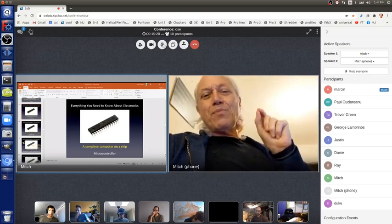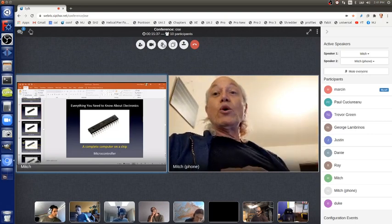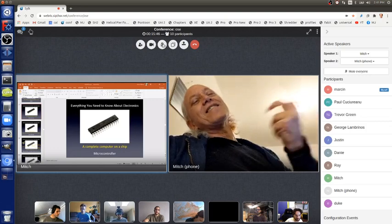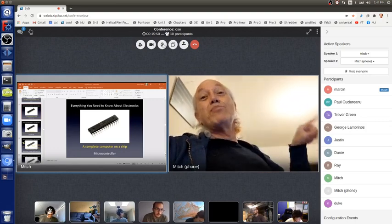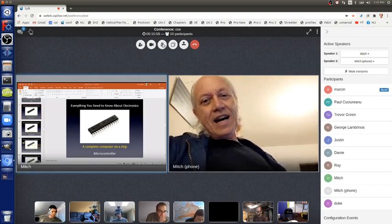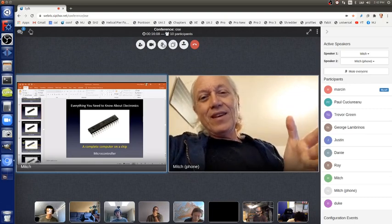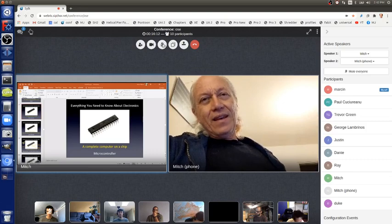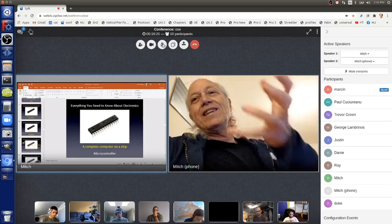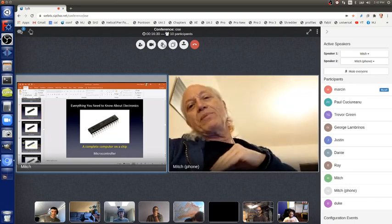Okay, so there's a small part of program memory that you need to have in there in order to use the Arduino software, and that's called the bootloader. The bootloader is a really small program. So when you first turn on the power, it actually doesn't go to setup in your sketch. The first thing it does is go to the bootloader. And the bootloader says, hey, is there a new cool program coming in from someone's laptop through the USB controller chip, to wipe out what's in my program memory and put a new program there? If there is, I'm going to go into a special mode called programming mode, wipe out program memory, and put the new program in my program memory.